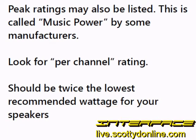You need to look at the per-channel rating on an amplifier first. An amplifier can be referred to as being a 100-watt amplifier, but if it has two channels, it may only be producing 50 watts for each speaker you hook up. For home theater systems, this can get very complicated — an amplifier could be said to be 500 watts, but the per-channel rating is divided up between six channels, so the actual punch from each speaker is lower than you'd expect.